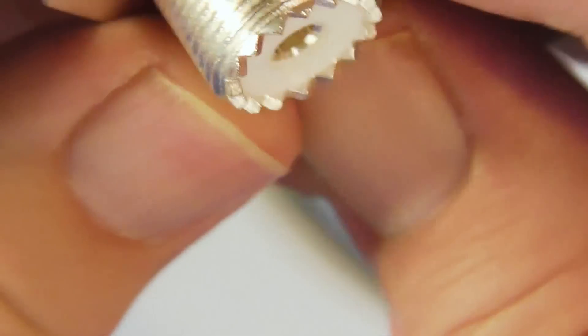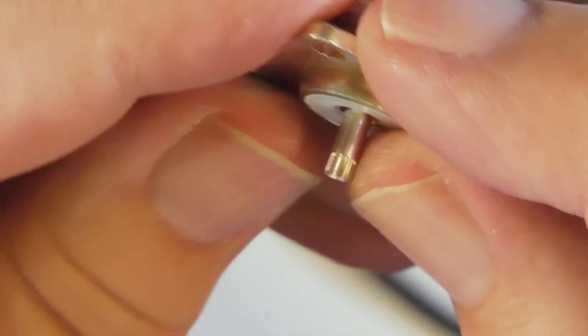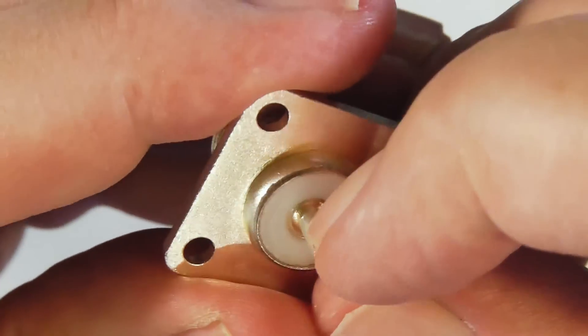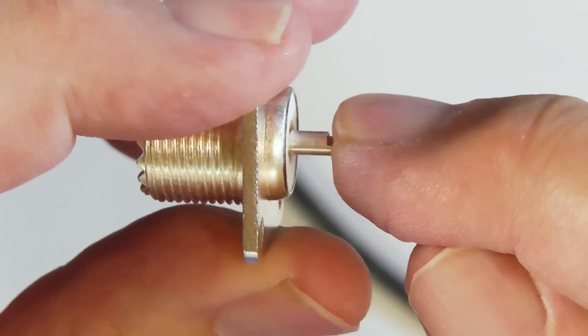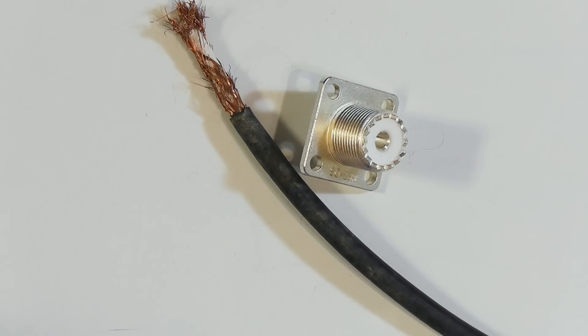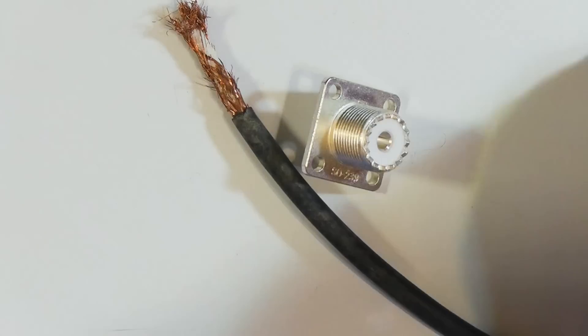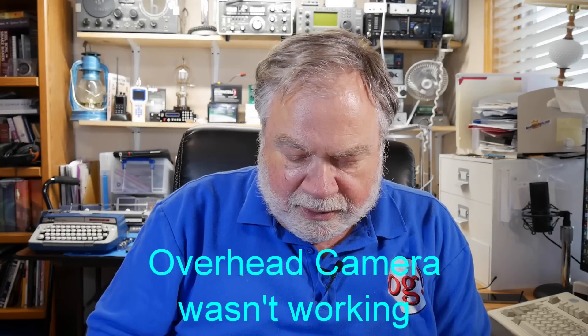It's got the threads for the connector. It's designed to be mounted to a bulkhead of some kind with screws, and then there's a solder connection right in here. One part of it is connected to the ground of the chassis, and the other part is the active part. The other connector of interest is the PL259. This is designed for much bigger coax — you put this on, scrunch this down, put this in here, put that over there and crimp it. You have the piece that comes out that needs to be soldered, and then you've got this crimped section.